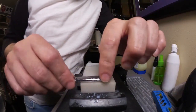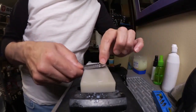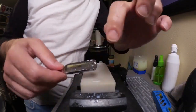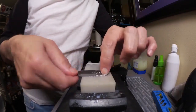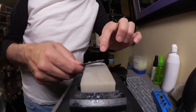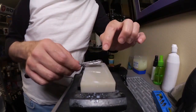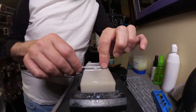So in the world of the Belgian coticule, I don't care about the speed on slurry. I want to know what's the minimum speed. That's the really important thing. And the minimum cutting speed on the white Arkansas that are hard is consistently better, no matter how you prepare the surface, than the black ones. Of course, you know that my black one I'm about to break out is 3 by 10 inches. So that makes up for a hell of a lot of speed variances, doesn't it? It also took me 4 months to shape that rat bastard.